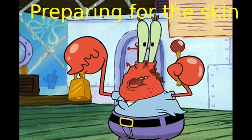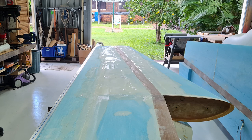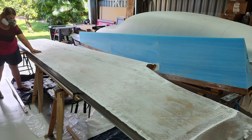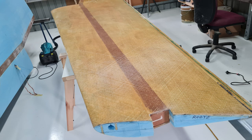Anyone know how many days it's been? I lost track. This is the fun bit — sanding, filling, filling, and sanding. The reason you'll fill twice is because the Velocipoxy seeps into the foam. Once it's dry, the filler will sit below the level you left it at, leaving you to do it again. One hot tip: make sure there are absolutely no high spots on the wing surface, but low spots are acceptable. The idea is that when the skin goes on, you can't sand the high parts out later without cutting the glass fibres. Any low spots can be filled with Velocipoxy over the top of the wing skin.